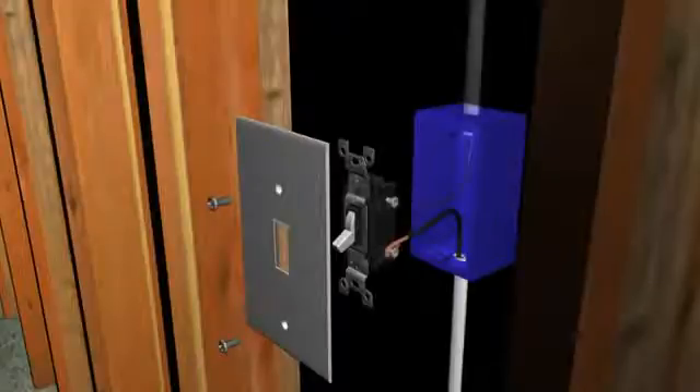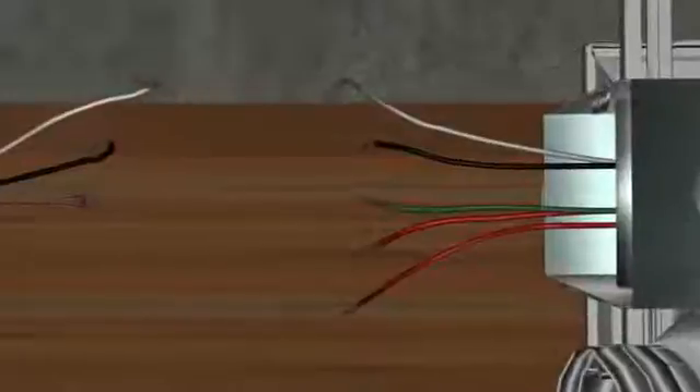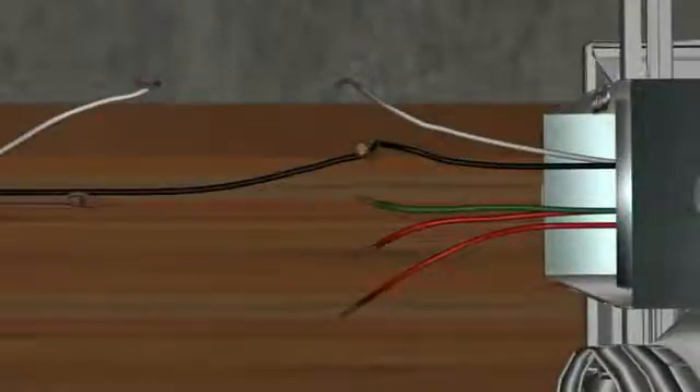The first wiring method we'll cover is the most basic installation method. In this method, we'll be wiring the fan for use as a traditional on and off spot ventilation fan, and we're not looking to add any of the plug-and-play modules offered for the Whisper Green Select. Wiring the fan with this method, we bring power from the electrical panel to a wall switch. At the wall switch, we attach the power conductor — the black cable — to the line side of a single pole switch. From the switch, we continue the run with the power conductor, again the black cable, connected to the load side of the switch, up into the fan's junction box where it is connected to the power lead — again the black conductor — for the fan's motor.